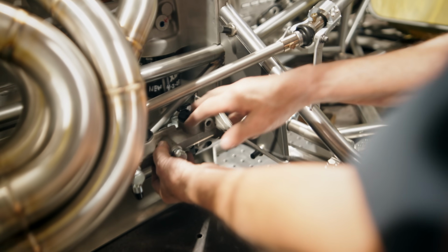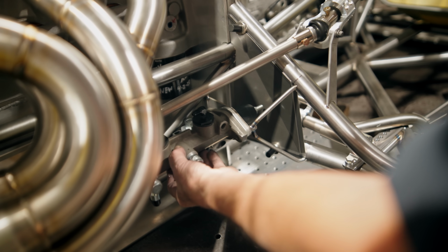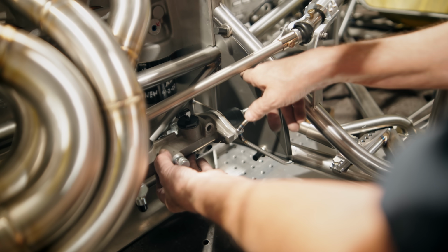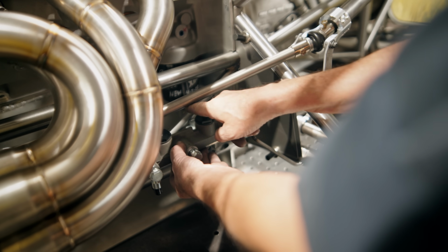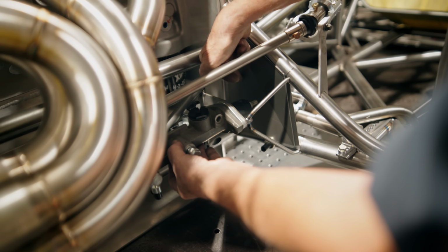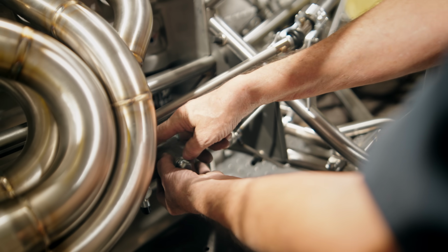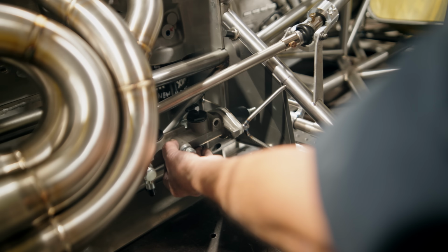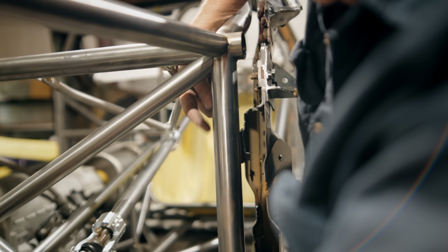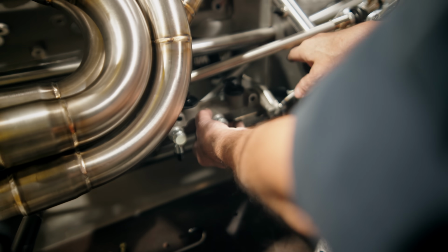Kind of a mock-up of how it's supposed to be. Right, this is not bolted in. I just got it held up here because there's no sense bolting it in when they're going to tack this in and do some welding back there. But this is kind of what it'll be like. You have two lines that are going to come out of here. One will come out and bend around and come back, and the other one does the same thing. And up here, there'll be two holes wherever I want to put them for a bulkhead fitting to go through. Instead of having a tank on your master cylinder, which is always in the way of the steering somehow, we have a little aluminum reservoir that we mount up here inside the car that holds the brake fluid. That brake fluid has to run down through the lines, come through that bulkhead fitting to get to this, because this is sealed off from the interior.